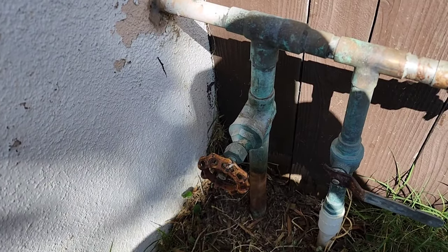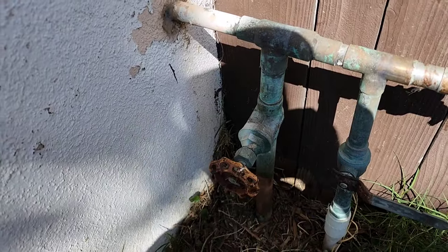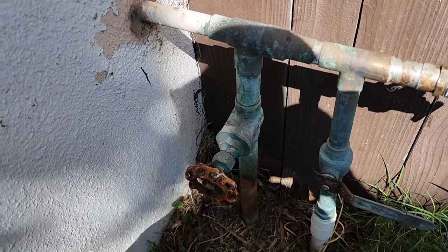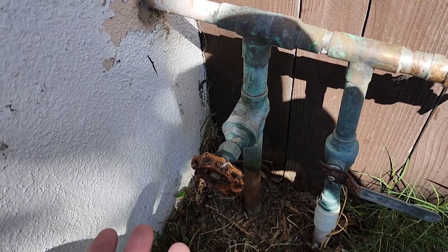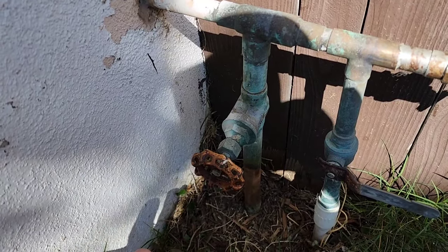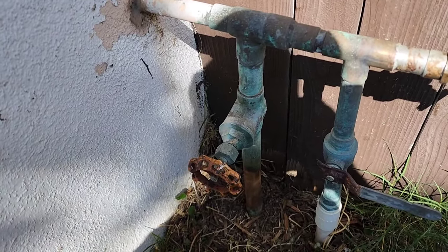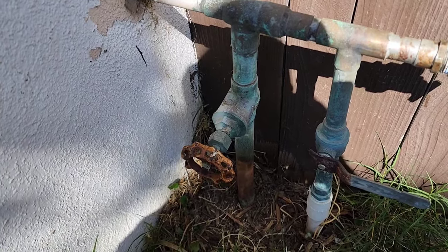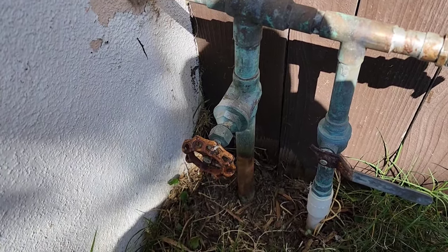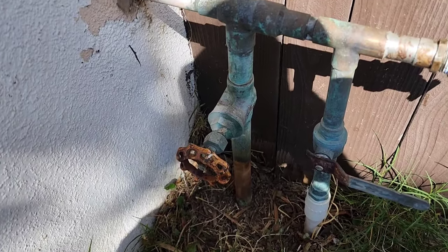And what'll happen is, while that valve is leaking, instead of going up your pipes and into your house and out where you're trying to solder, it'll fill up the water in that meter hole if it's dripping a lot, and you can just get a cup and take it out, depending on how long you're going. But usually when I've had to do that before I had a ProPress, I usually got the job done before the water was filled up too far. And I also have a hand pump.